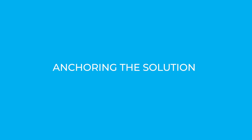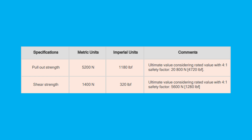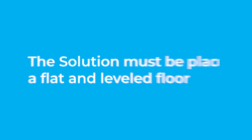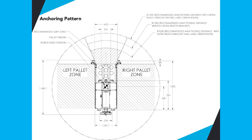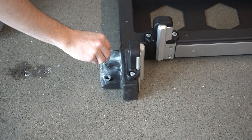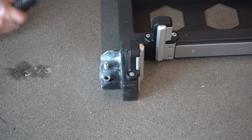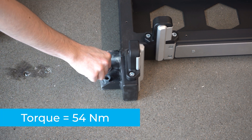Anchoring the solution. If you use the anchors provided with the solution, they should be installed in 28 MPa undamaged concrete minimum. If you choose to use other anchors, each anchor should be able to withstand at a minimum the following forces. Considering that the fastener's rated values are 25% of the ultimate value, the solution must be placed on a flat and leveled floor — otherwise, use shims to level it. Before choosing a final position, double check that your layout is correct and all distances are respected. Once sure about the final position, drill the six holes with the provided drill bit. Place the anchors into the holes and fasten the nuts flush to the screw. Bang the anchors in place. Secure the solution by screwing the six nuts to a torque of 54 Nm.